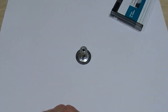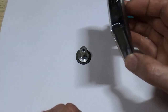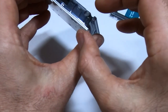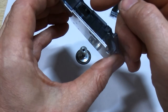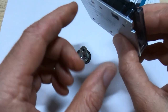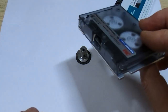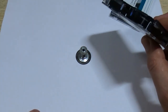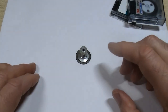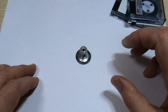The idea was to modify the drive to use DC 2000 tapes. The tape housing is thicker, the tape itself is wider, and the drive wheel is about two millimeters or so higher up relative to the base plate. Other than that the tapes are kind of interchangeable. In this video I'll briefly explain the method I'm going to use to modify this and then look at how to machine the parts we need.